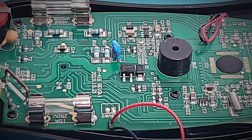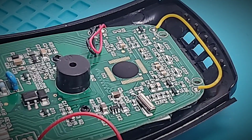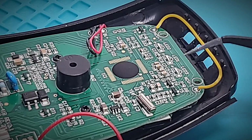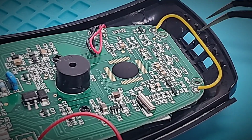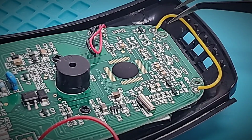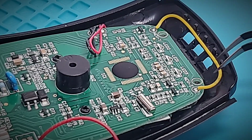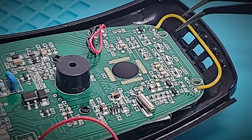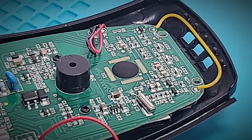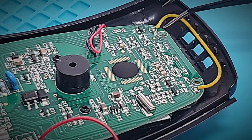And check this out here, moving up the line. Do you notice anything? Well, besides the IC being cobbed and the silver can, aka oscillator. Look at the NCV. You don't see that every day, folks. We have a wire embedded from one side of the PCB soldered into the other, and that wire is our non-contact voltage detection.